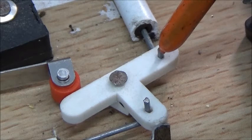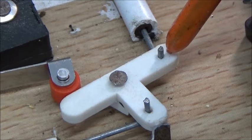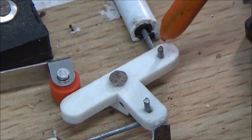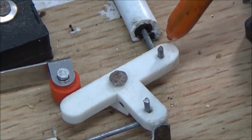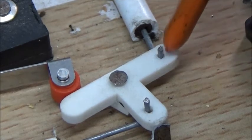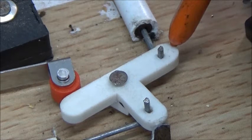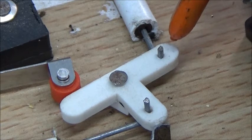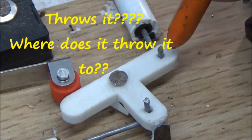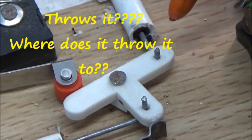I'm using 1.25mm galvanised wire, bought in rolls of 50 metres for about $7 — very cheap. You just snip it off, straighten it out, and bend it. It doesn't really matter what wire you use as long as you drill the hole to suit. These bell cranks have been in use for a good two years now with quite a severe movement when the point motor throws. Zooming in, you can see there's a bit of a gap and some wear on the lower one, but they've lasted quite well.